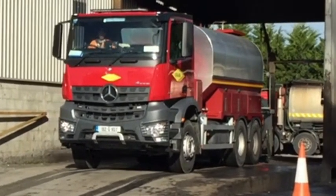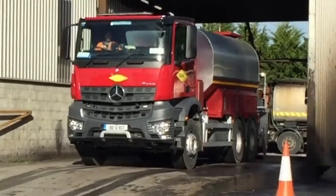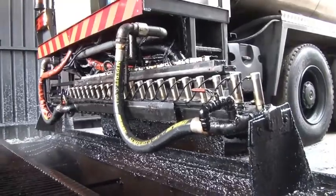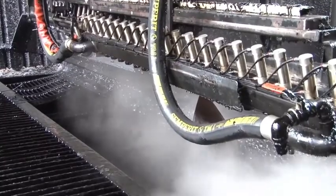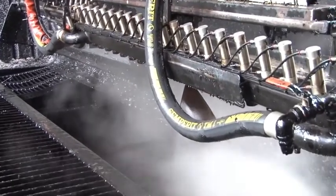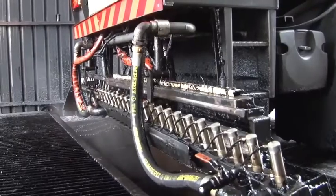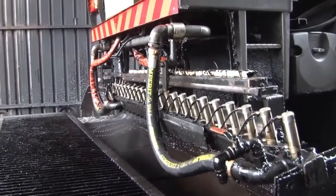For this purpose, all of the Colchon sprayers are calibrated on at least an annual basis. The calibration initially involves checking the distribution of the individual jets on the spray bar. These are checked to make certain that there are no visible defects on any of the jets.